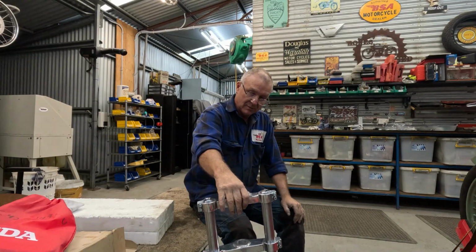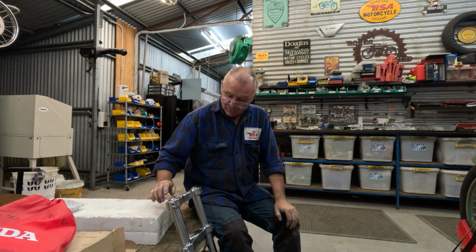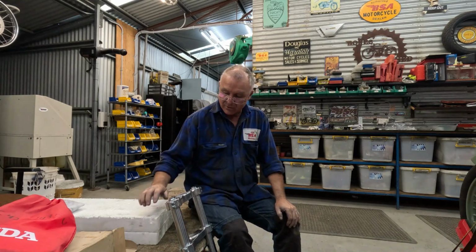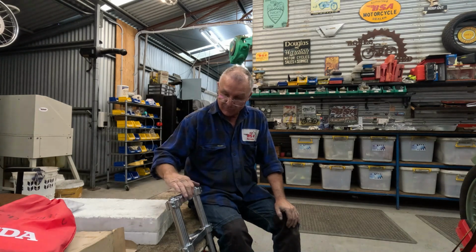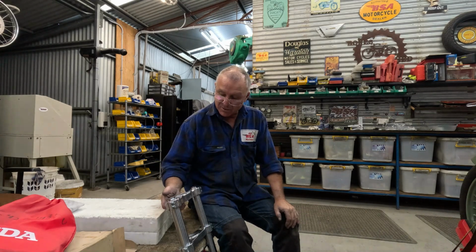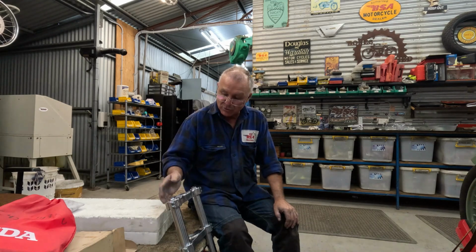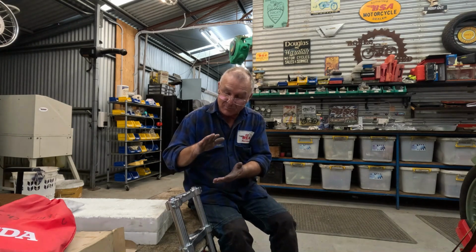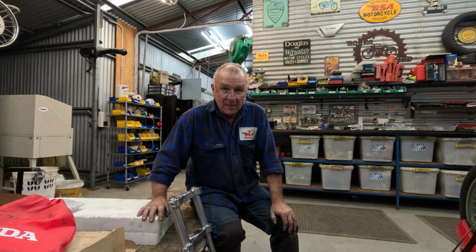Okay, another job on the Celix Racer done. So I've still got to make up the spindle to go through here. The only issue I had was, if you remember from the actual casting video, because I had a slight depression in the back of the casting, I'll put a little counter bore in, and I'll put a little steel top hat bush, so that will sit against the top bearing, because I need a full contact area to keep it square. But that's not a big one. I've done the counter bore and everything like that.